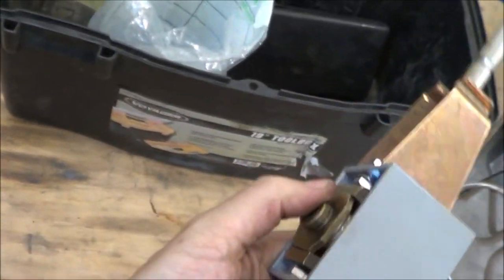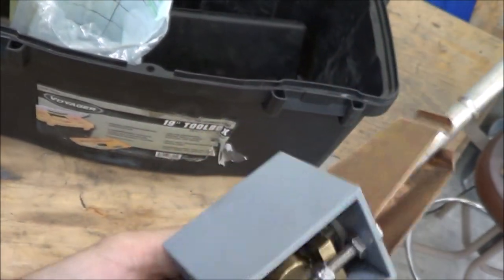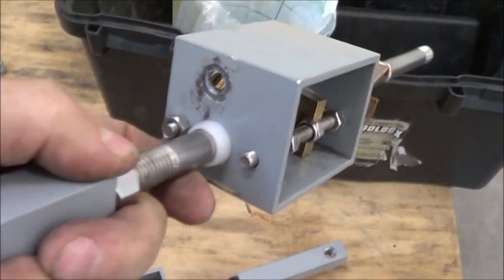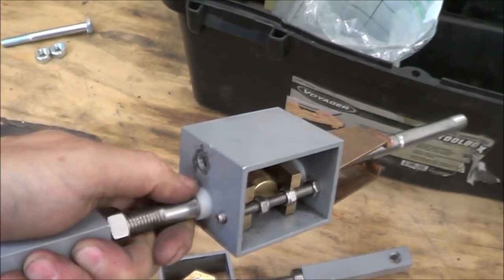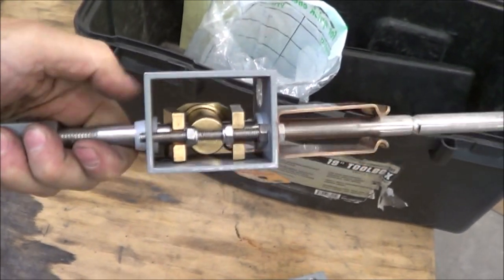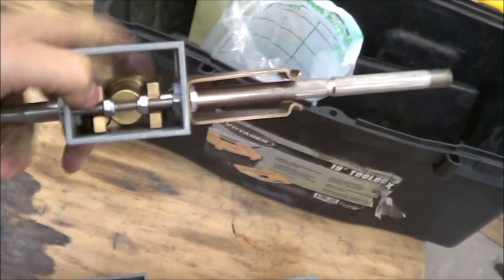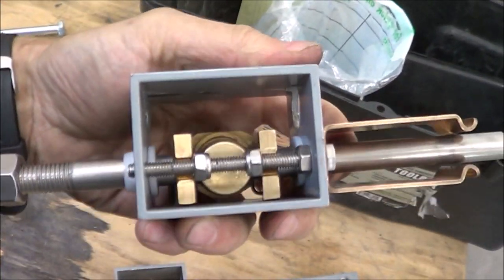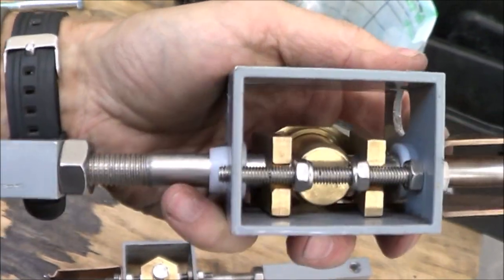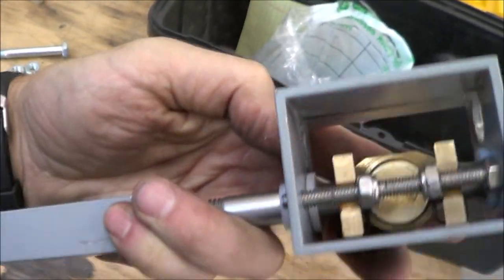So that tells us that actually it's force transmitted from the bucket through this brake box that's causing this brass fitting to lock up on the slider bar. Now here's another interesting point. Right here is where the cable attaches. So the cable's pushing above the sliding axis. So whenever the cable's pushing or pulling, that implies there's a rotational torque about the sliding axis, and it has to be compensated for by this plastic piece and the plastic piece on the other side of the slider bar. So that means there's going to be a heavy friction contact point there as well. So there's two contact points on the plastic pieces, and then there's going to be two contact points on this brass fitting, and it's all due to rotational torque that's created by this brake box.